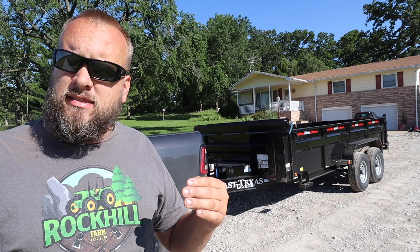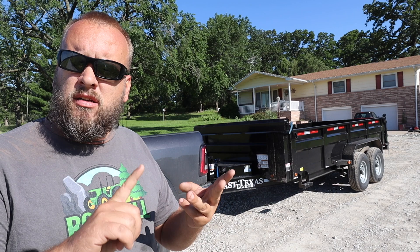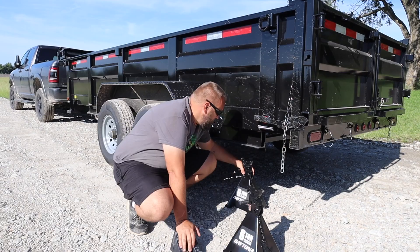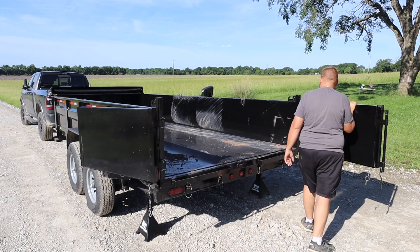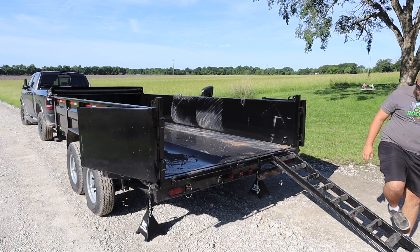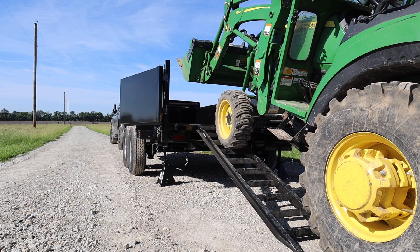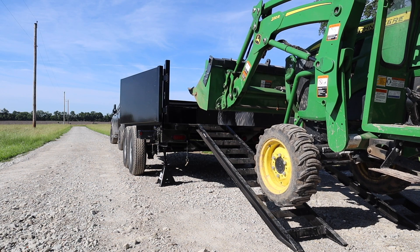Some of this is going to feel like a repeat of yesterday because I'm going to take the same safety precautions: parking brake on the truck locked before I start, wheel chocks on the trailer, jack stands under the back of the trailer. I'll get all that in place real quick and then bring the tractor down and see how it goes.